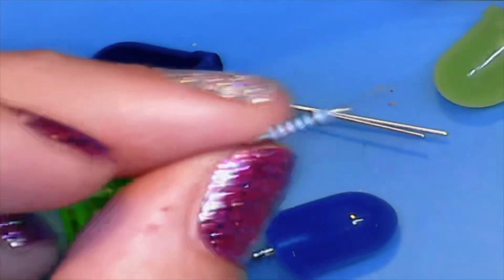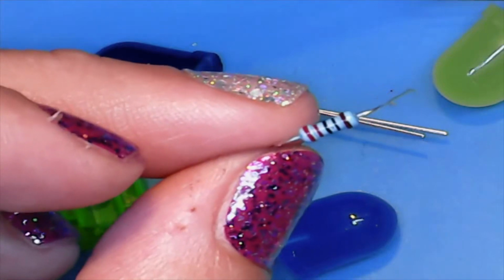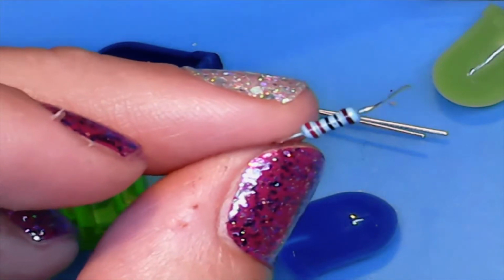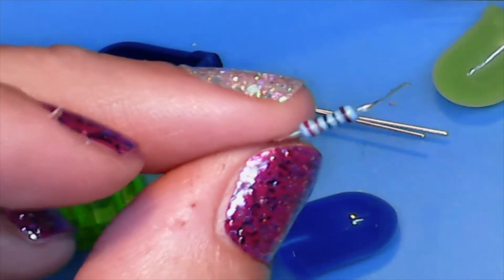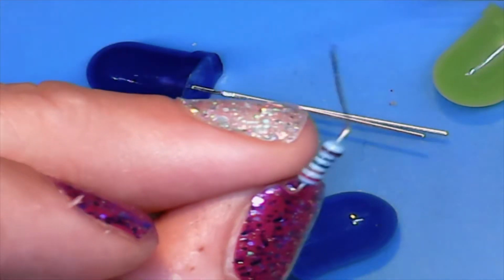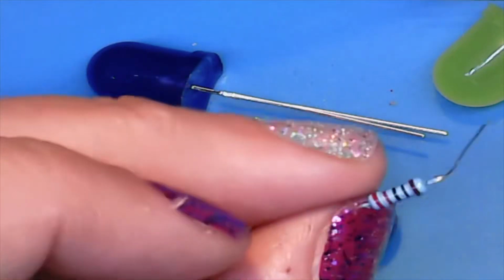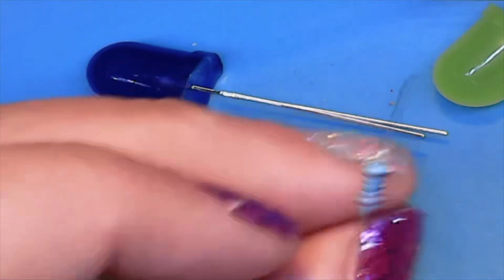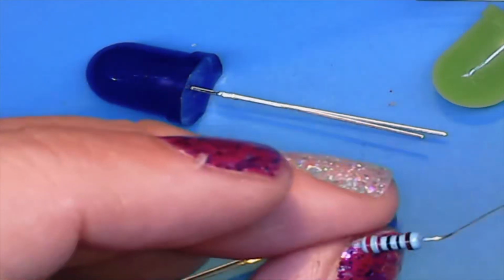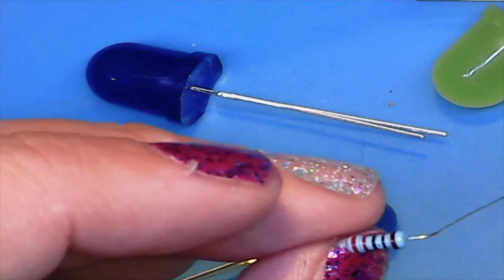And so this is a 220 ohm resistor. This is a 5-band, so it's supposed to be, and God, the light's bad in here. I think it's red, red, brown, brown, black, or my vision's going bad and it's something else. Either way, 220 ohms, they should have been marked in your kit. I don't have a beige 4-band handy, otherwise I'd show you what that looks like as well.